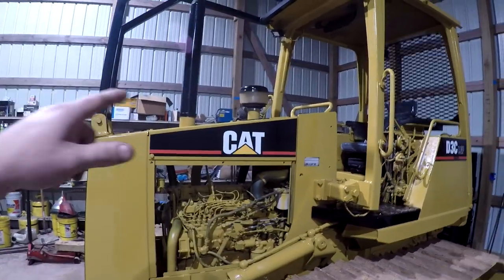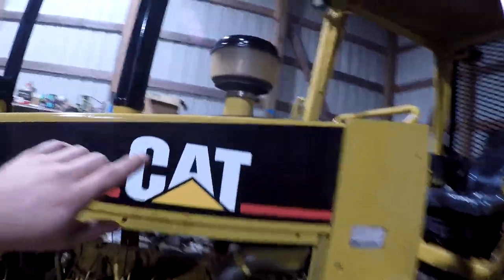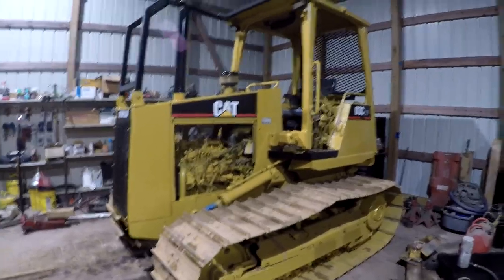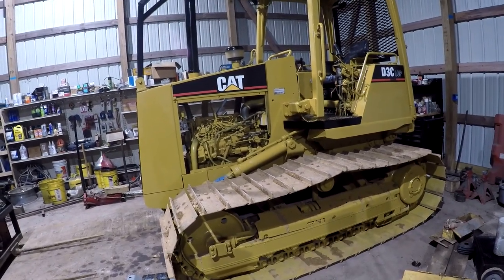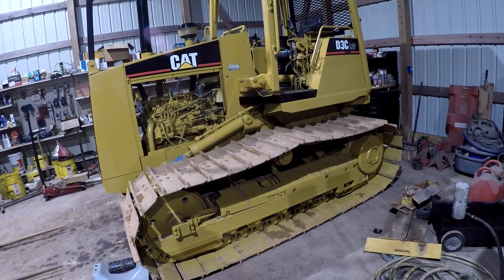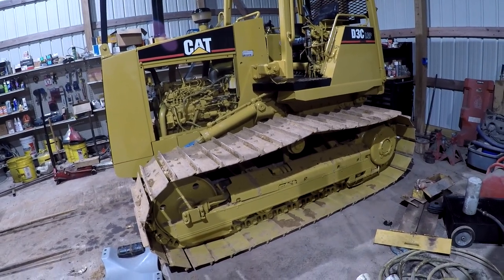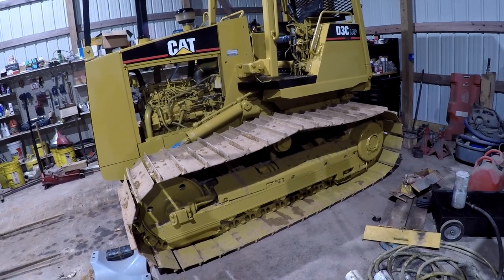Got the pre-cleaner up there cleaned out. I could have ordered a new one — they're about $40 — but I just cleaned the dirt out of it. It kind of works like a bagless vacuum: the air goes in and it's like a bowl-shaped deal, it goes up through the center and the dirt settles on the outside. A few little knick-knack things I've got to tidy up and touch up. Then we can get started on the blade. I have the bearings for the mounts, I just haven't got to it yet. We've got to get the blade cleaned up and painted, and I've got a new cutting edge to order. I'll go ahead and wrap this video up and we'll figure out what we're going to do in the next one.